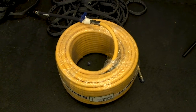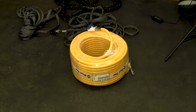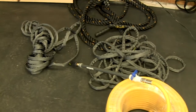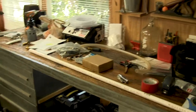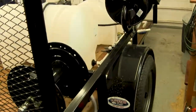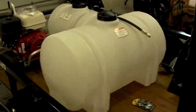Starting down here on the ground, I've got some 200-foot Accutech hose — that's my soft wash hose, it's a half-inch hose. Right next to it you see the Zero-G kink-free hose — that's two 50-foot strands. Had I known it came in 100-foot strands I probably would have grabbed one of those. The reels are all set up: the back one is my soft wash reel, the middle reel is the supply water for the water tank, and the forward one is for the high pressure side.